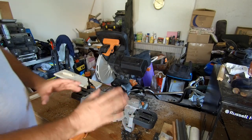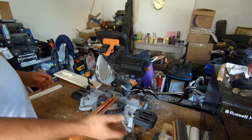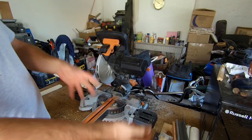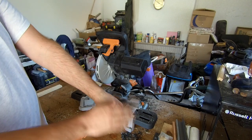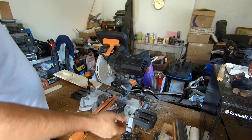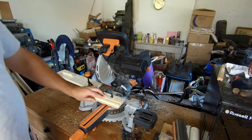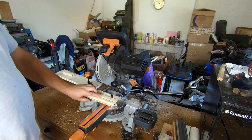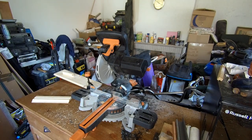You don't want to just be smashing it down when cutting through metals because you've got a chance of the metal bouncing around and you do get bits flying off that are quite sharp. So probably gloves — and definitely wear safety glasses while you're doing this.